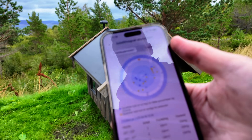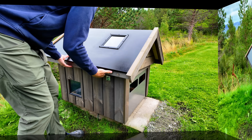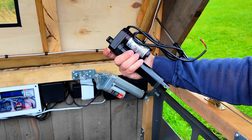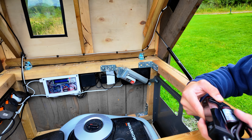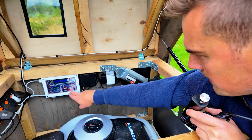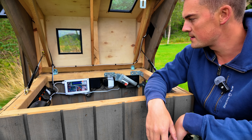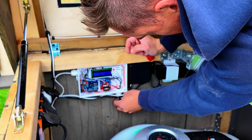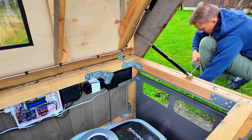After adding the two skylights, the signal quality is still poor but good enough. So on to the next upgrade. I'm going to swap this quite slow linear actuator with a really fast one - it's about five times as fast. Since this new one is a lot faster it will pull a lot more current from the electronics. This is the H-bridge powering the actuator; it's currently set up in single mode, so I'm going to do some rewiring and programming to use both channels so it can handle a lot more current.